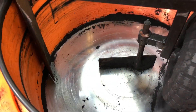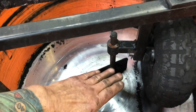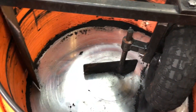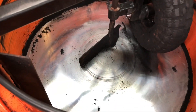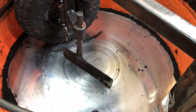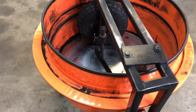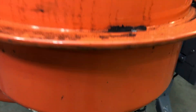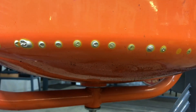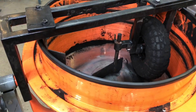The most important part about this whole sand muller is going to be this base. This base is what's going to allow this wheel to compress that sand down, and that's where all the mixing, kneading, and blending action is going to happen. I made a cardboard template, got it to fit really good on the bottom, and then I just took my plasma cutter and cut it out. But if you don't have a plasma cutter, no worries — use a cutoff wheel, use a saber saw, use whatever you have. I know a lot of us just starting out don't have all those fancy tools. I just tacked it, and you can get an idea of how far up it sits — right at the tangency of that radius. Just drop it in and weld it in. You've got to have that; this will not work without it.